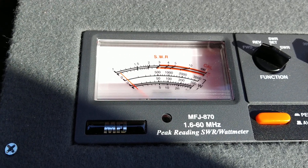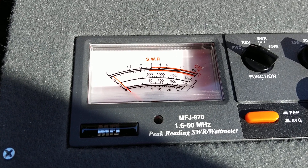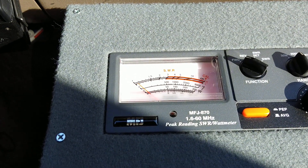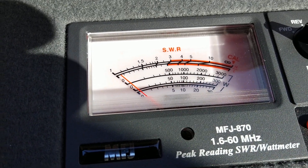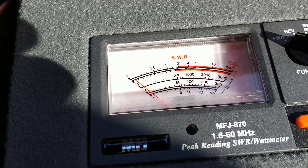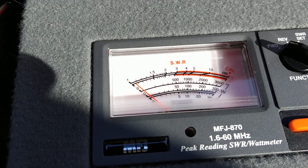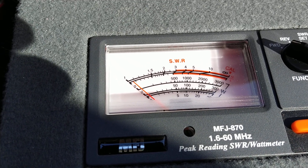In reality the dead key is probably a little higher, but we have to read off of this meter. Since I retrimmed the antenna, started the truck — truck's running — keyed up, my dead key shot up to 200 watts on this meter. And that makes sense because you're changing the antenna system. The antenna was obviously more resonant, more on frequency. So it brought the dead key up on the amplifier. It makes sense.